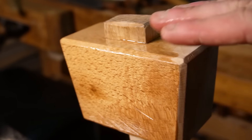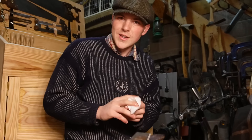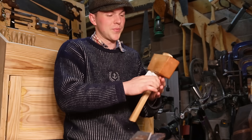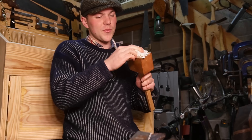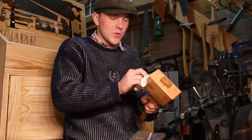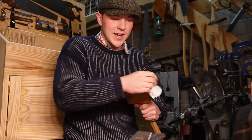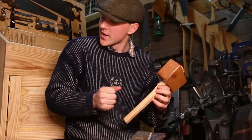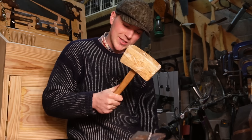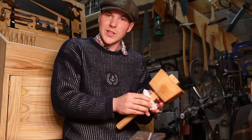Adding the linseed oil is definitely my favourite part of any woodworking project. I'm going to grab some tissue now — I've had it setting for about 10 minutes just so all the oil can soak in. Anything that hasn't soaked in by now we'll just wipe off, making linseed oil the easiest finish you can add to any wooden product. I know some people like to varnish or stain them, but I think linseed oil is the best finish. When you're using a tool handle for long enough, the oils from your hand get transferred to the wood, and after many years of use there's a lovely shiny polished finish to it that you can't really replicate with anything else.